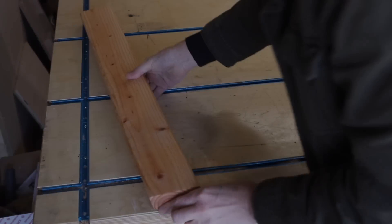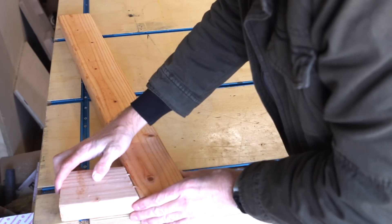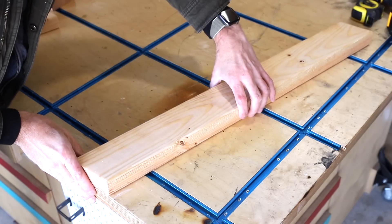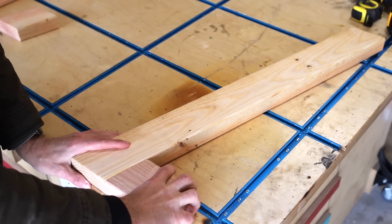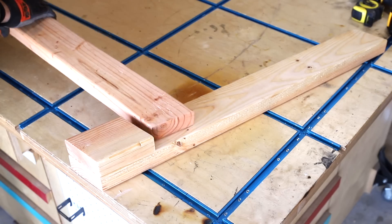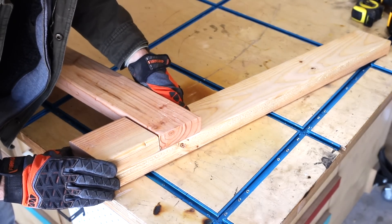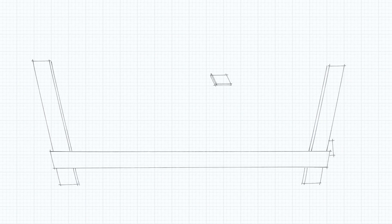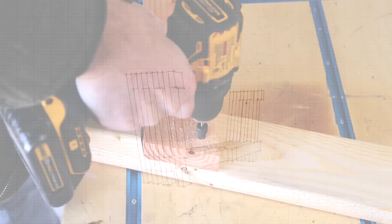On to assembly — this first stack of pieces is the most important to get lined up. I used the edge of my workbench and a scrap block to ensure the armrests are splaying outward at 15 degrees and square to the floor. I intentionally made the armrest spacers the same height needed for the seat stretchers so I could use those as templates during assembly. Here's a quick diagram of how this all goes together layer by layer — it's pretty simple and everything is covered in detail in the build article.